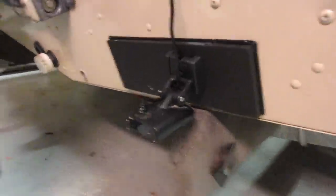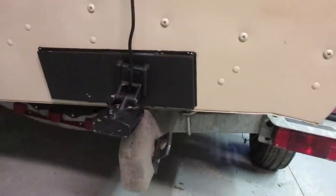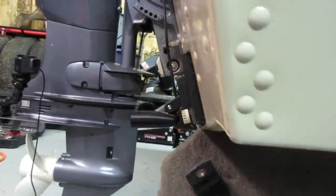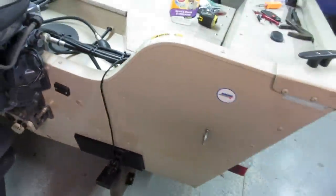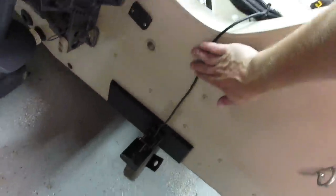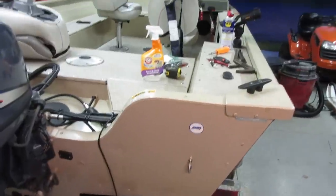Here's one more shot of it all done. You can see the silicone I put on there — it's all dry and looks pretty good. I've got a couple different places I can move it around if I want. I've got it fairly level with the bottom of the boat right now; I might adjust the angle later. I might anchor the cable down with some stick-on clips once I get it set to the right position. Other than that, she's ready to go with the fish finder. If you liked this video give it a thumbs up, subscribe to the channel, and we'll see you next time for the next mod on the boat.